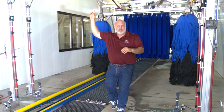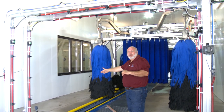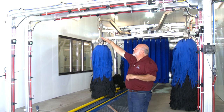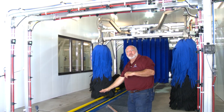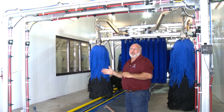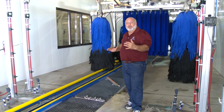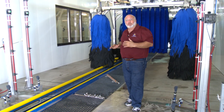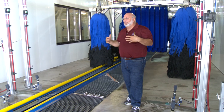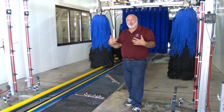It won't spray the back of the car — that's where the top comes in. Our top nozzles have the tips pointed backwards, so our fan is coming down. We activate this right about above the windshield, where it'll come out and spray over the hood, spray the windshield, and then as the car passes, it'll actually coat the back of a van all the way down. On a slow chain speed, this arch is enough to get your chemical on front, side, and rears of the vehicle. We've also got floor applicators that assist us in getting the very bottom of the front and back of the car, which is critical. We need complete chemical coverage on the vehicle so that whenever we touch it with our friction and high pressure, we can actually clean. We can do all the friction and all the high pressure, but without the right chemistry application, we won't clean the car.